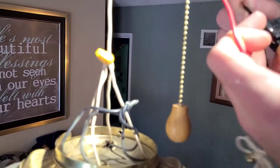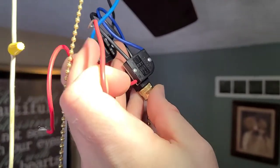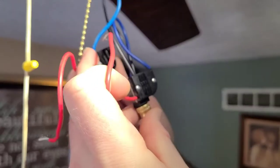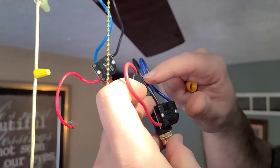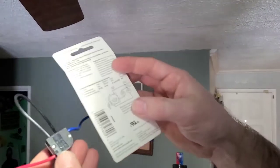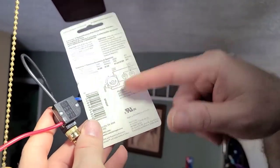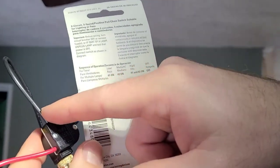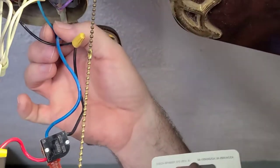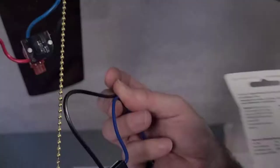We are going red. I always double check even though they should be. These wires are not the same — see it? So red, black, blue. I'm going to check the diagram that came with this and make sure it's right. It could still need black to black, blue to blue, but since they're coming off a different spot, I'm guessing this black is going to go there. Don't get confused. Red is still one. But on this one it says two white — there's no white wire. This one says it's supposed to be the black, and that's supposed to be the white. So they're mixed up. This black is going to have to go to this blue if this is wired correctly originally. They're going to have to be backwards by the way they wired the switch. That's one for low, that's medium, that's one and two and off.